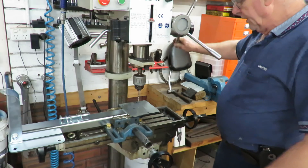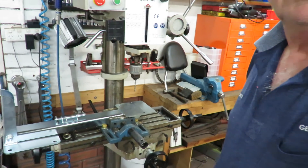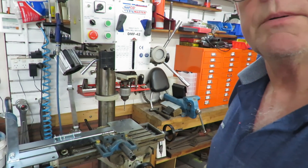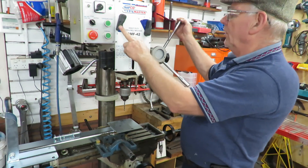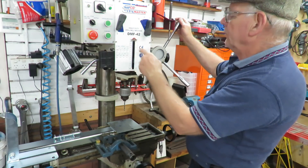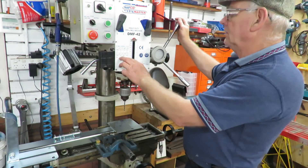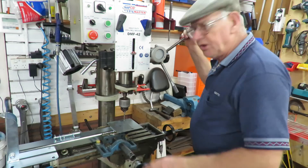I'm doing a drilling exercise. You can see the fast and slow speed — we're on 2L, which is too low, so we'll run it on the fast speed. The speed range goes from 95 RPM to 3300 RPM, giving a range of 12 speeds across the gear positions.